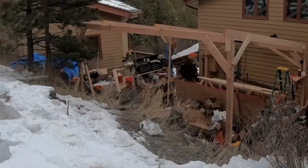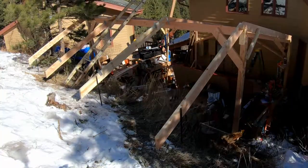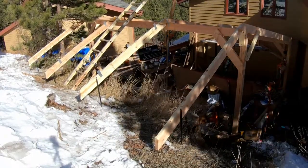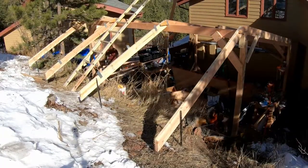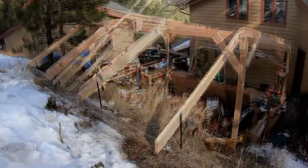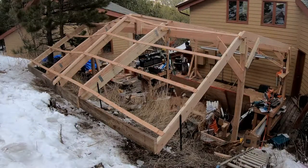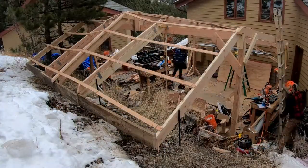The last thing I wanted was the rear of the tent to collapse with the accumulated ice and snow and fall into the area where the deck was. So to stave off that I added a set of rafters to the back of the tent up the hill a bit. Additionally I added a little bit of wood on the rafters so that they would have a peak more or less and added a ridge beam. This allowed me to add a bunch of battens which connected the rafters and would help support all the snow but also help let the snow slide off because there'd be an angle to it.